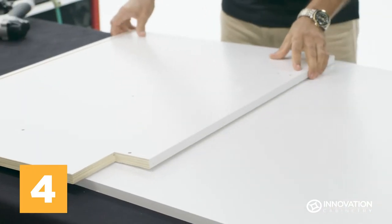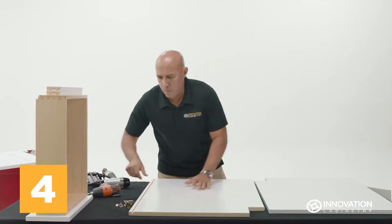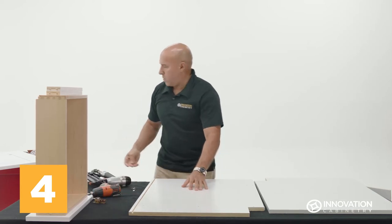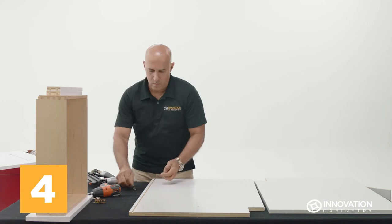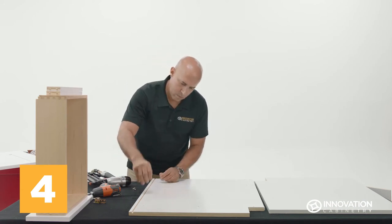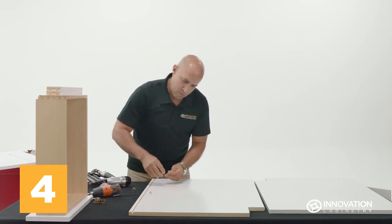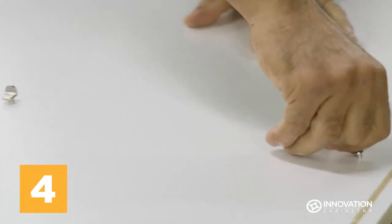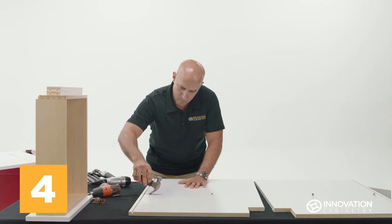Place the base's sides on your workstation, positioned with the pre-marked and pre-drilled holes face up, the slots to the outside, and the notched corners facing in and across from you. Insert the internal shelf pegs into the holes along the middle of the sides, then tap into place and straighten with a hammer.